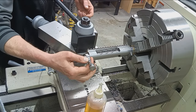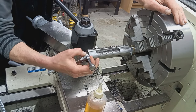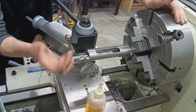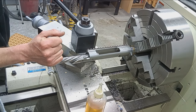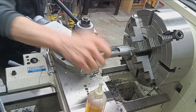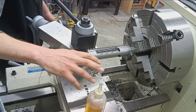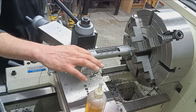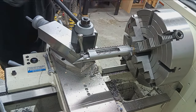Now if this didn't wiggle at all, that would mean the bolt nose is up against the barrel. And we don't want that. We need some clearance, especially out here in high desert Wyoming, it's very dusty, and competitions are held in the dry-ass summertime. So the guy's sitting there waiting for his round to come up, probably has his bolt open, wind's ripping through, dust is going in there, goes to chamber a round, and oh no, he can't close his bolt, and it's all gravelly. So this ensures that there's clearance in there for the bolt to work. Now, that being said, once the headspace is achieved and the cartridge is in the chamber, there will be no wiggle because we don't want it for that. So that completes that operation.